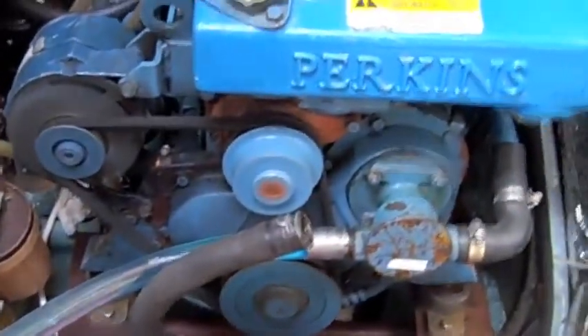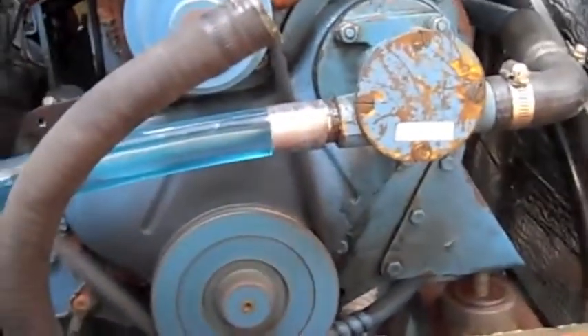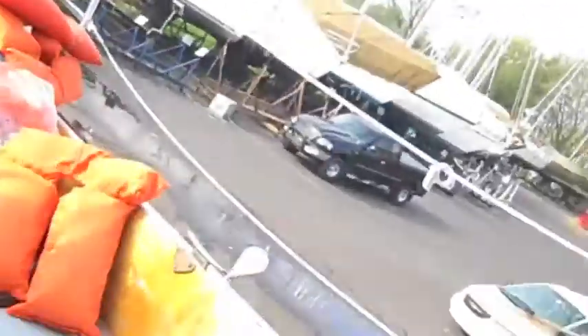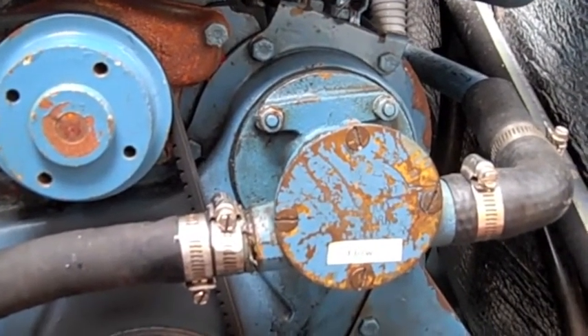Engine's drawing antifreeze. I'll check the output to make sure that we got blue coming out of the exhaust eventually. Before it gets too low, we'll check. Yep, got blue coming out of here, so we'll just let it go until it's totally blue. All right, so the raw water side of the cooling system has been winterized.